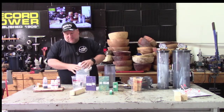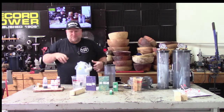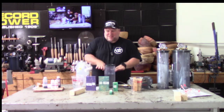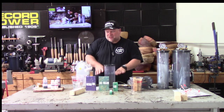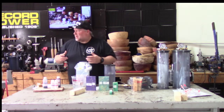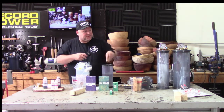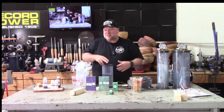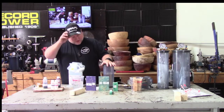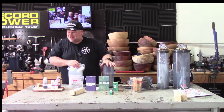You can mix up partial jugs, like if you put them in old water jugs or milk jugs, you can add colors to different ones. But keep in mind, you got to have your resin high enough to cover your material. So you're going to need quite a bit. So it's generally good to do like a color at a time. And then you can always pour back in what you don't use, clean out your chamber, and do a different color. So it's not like you have to get rid of it, but you do have to do that. So I think, I don't know, do we want to talk about multicolor stuff?